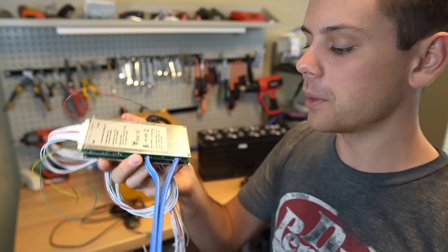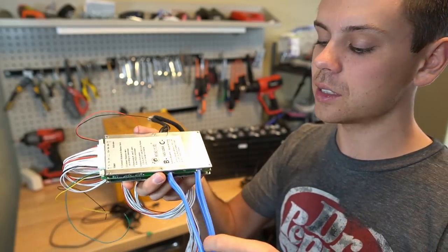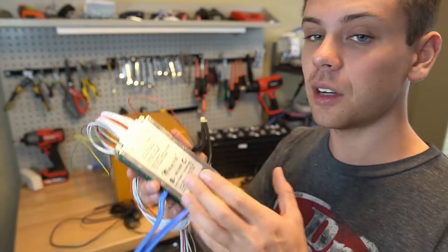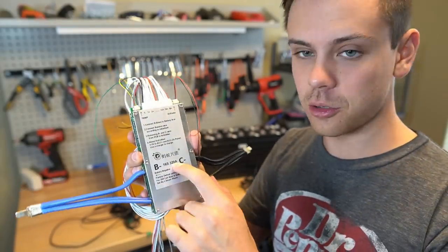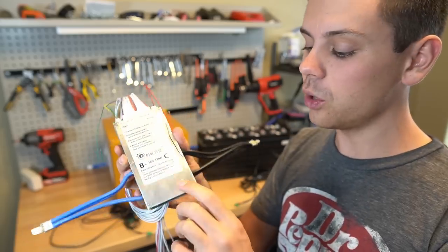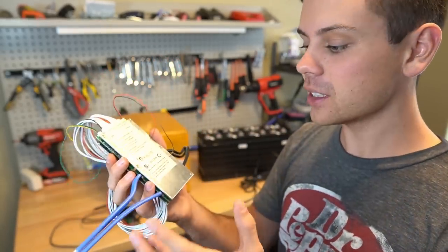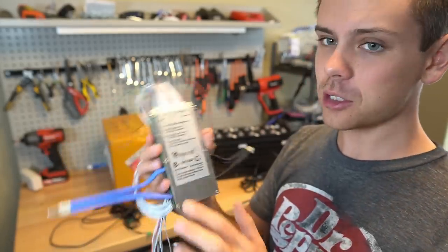I wish they'd done what a lot of newer BMS manufacturers are doing — just using a huge relay or solid state relay. But this will work just fine, the MOSFETs are good. If you have surge loads you want safety headroom, so even though this is rated 320 amps I would not push 320 amp surge loads from an inverter through this — it will damage it. But if we're just powering a 100 amp load with a 48 or 24 volt battery system, this will absolutely work.